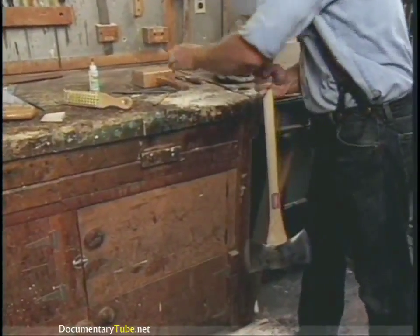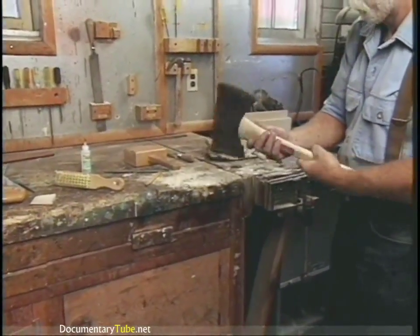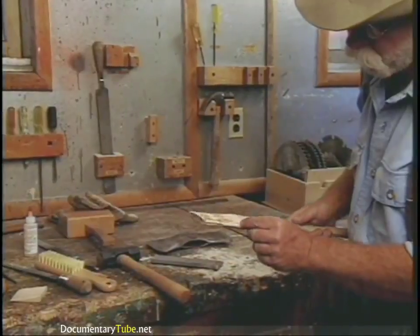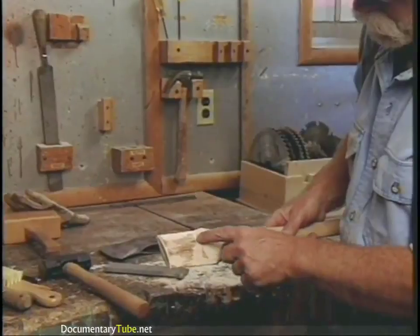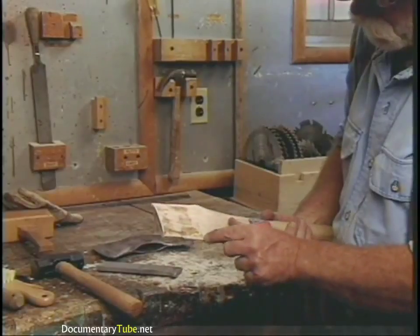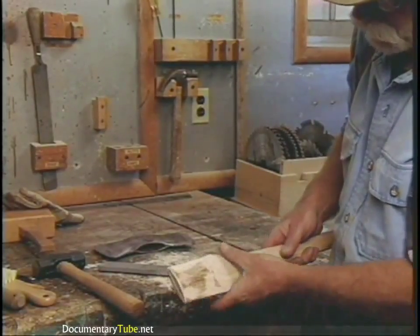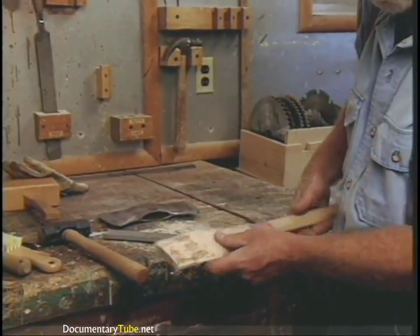It's about shouldered up. Not bad for a first try. Let's back the handle out a little bit here. You can see right here where it was shouldering up and rubbing, and you can see it was a good tight fit through here. Notice the places where it's high — we're going to take a little bit more down through here, a little bit of this, the high spots right here, and then I'm going to feather this up so it's a good comfortable transition instead of an abrupt transition.